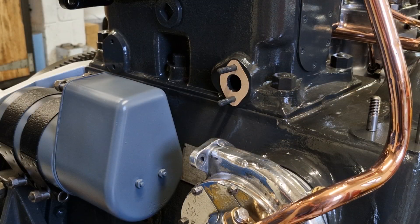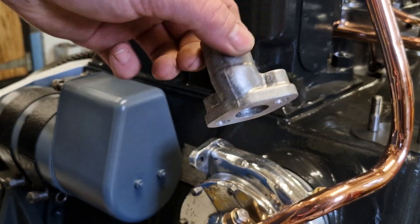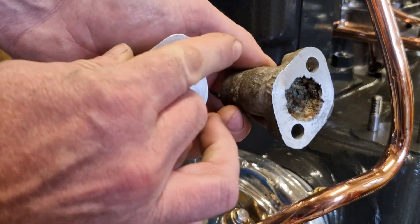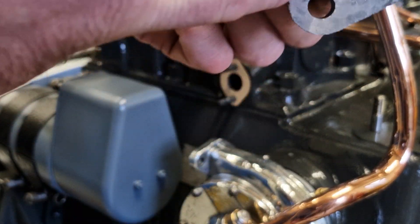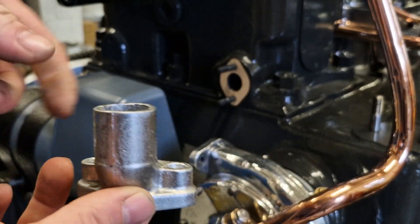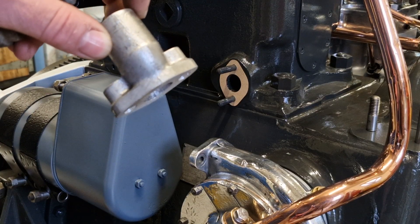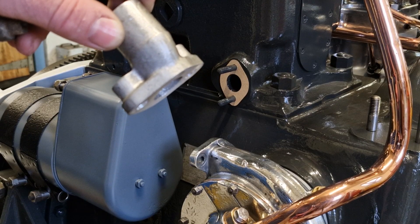So now we've finished casting and after a quick spin on the lathe and the mill, we now have a fully machined water inlet. There's the old one — quite badly corroded as you can see compared to the new one, and it is cracked just here. There's a crack through there and it's obviously not a lot of material left. So there's the new one — we'll fit that on, and then once we've done this the only job left to do is to make up an injector pipe and then we are ready for filling the engine with fluids ready for a test run.